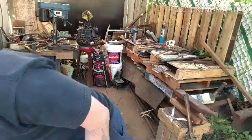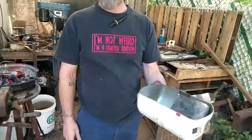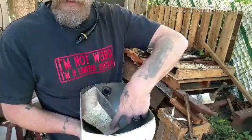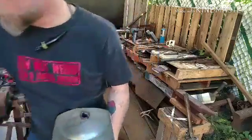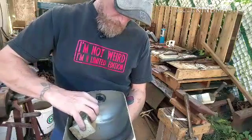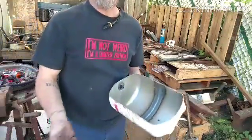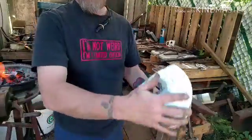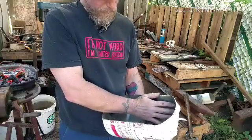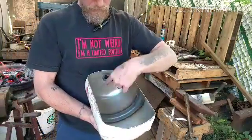Like I was saying, take some of these bricks here, have the bar come in. Yeesh, that's not gonna work. Take a gander. Right here's where my bar is gonna be. Right here. Guess we're gonna have to cut them in smaller pieces. Put them in there like that. Run the bar in there and put them in there like that against the bar so the air hole. Alright. Or, the other option, get the bar in there, pack it up with some dirt and clay, something like that. I want an angled side going down to the tuyere.